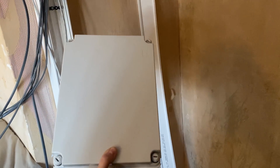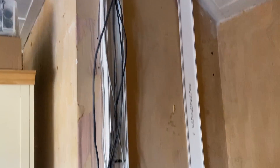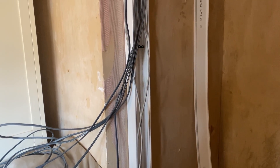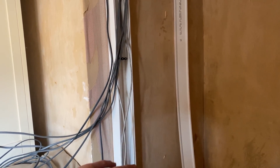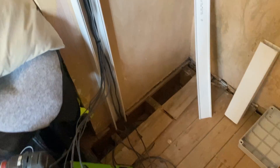I'm going to dress all these cables nice and neat. The customer prefers the two boxes whether that's low level or high level. This little alcove section is all being made into a wardrobe so it'll all be hidden. We've added trunking rather than chasing the wall for future proofing - the customer mentioned he's having a wired CCTV system installed, so he needed a place to run all the cables up.